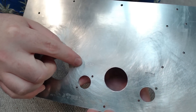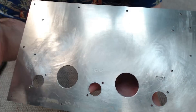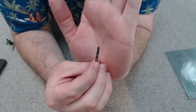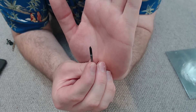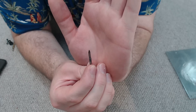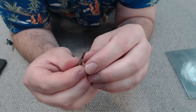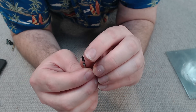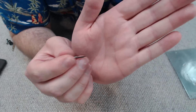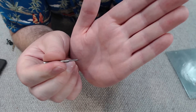Now let's talk about engraving. I've engraved this text on this alloy plate — it's four millimetres in height and one tenth of a millimetre deep. The style of cutter I used for this has a few names; sometimes it's referred to as a V cutter, sometimes as a knife or a flat cutter. You can see on one side it's completely ground flat, and on the other it's obviously the radius of the shank. You can get these in varying pitches or angles to give a different look on the text. How far you plunge this into the material will also give the edge a chamfer to the text and give you different looks.